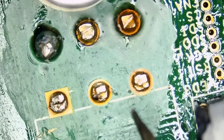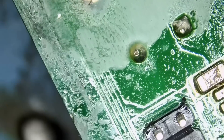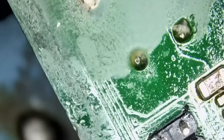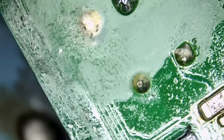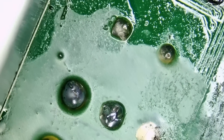We cannot apply a lot of heat in this area because of the capacitor right here. We may have to remove it to safely work on this area, otherwise it will pop — you've seen it happen in previous videos. If we flip the board we can remove the cap, but we also can't apply too much heat because of plastic nearby. We're going to have to apply low melt solder.